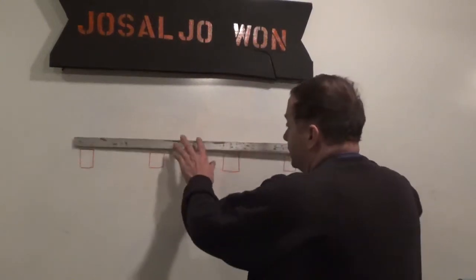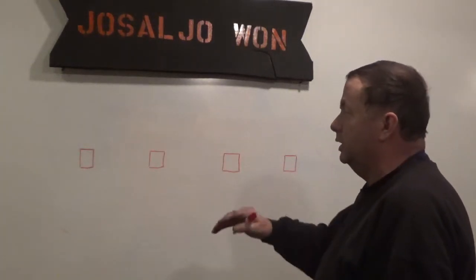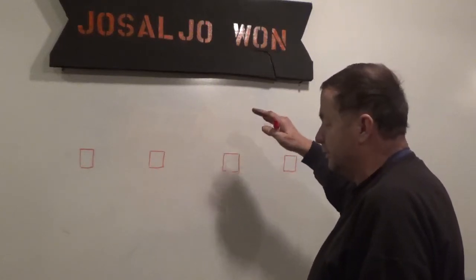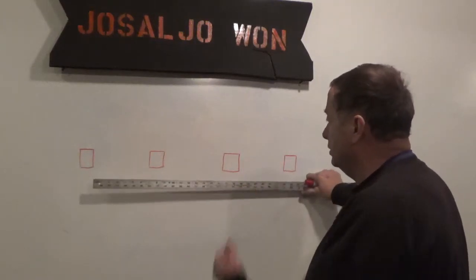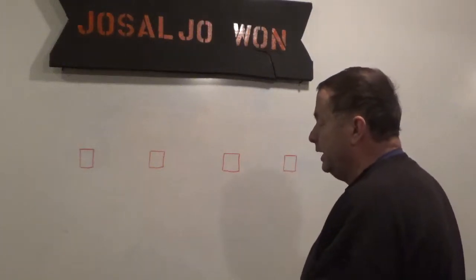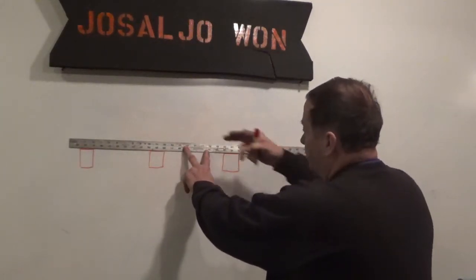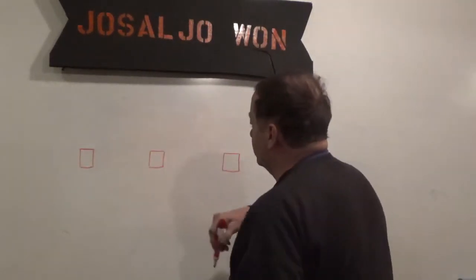geometry, okay? First of all, when you level the sawmill, and why you would not want to level the sawmill, I will never know. Why you would want to put the sawmill canted one way, canted the other, or whatever, I mean, it's up to you. You can do what you want. But to me, leveling the sawmill sideways, lengthwise, and every other way, the frame of the sawmill is the way to go. That's what you should do because you can use it to measure from. So anyway, if you look at this representation here, we have a straight line. So we can assume that this sawmill from bunk to bunk is level with one another.